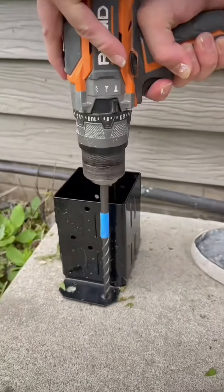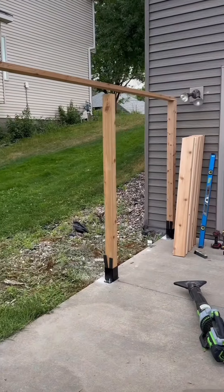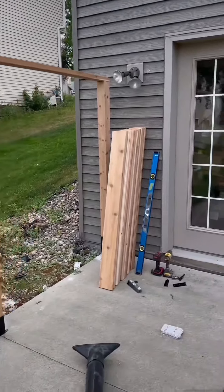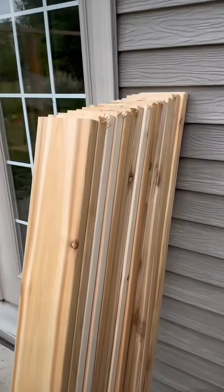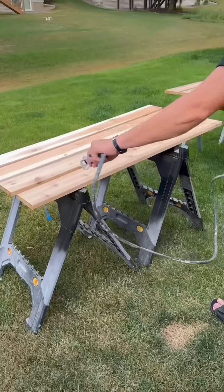We have to start with our posts, and those are going right on top of the concrete with these little brackets. Now that I have those set, I'm going to put the posts in, get them level, get them plumb, get them square. Also going to put a 2x4 across the top just to hold everything all together. Once I knew those distances weren't going to move, I can cut my boards to the exact length that I needed. I set up a little jig and got the exact measurement every single time, and it actually went pretty quick.